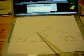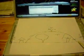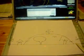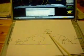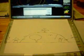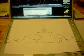You have this long arc, and within an 8 to 15 minute period the satellite is going to travel from one end to the other. Somewhere in there you're going to have a peak — that's your best chance of acquiring signals from the satellite. But anywhere along the arc you might catch a signal, and with a setup like mine you'll be moving the antenna around a lot. This gives you a good approximation of what to do.